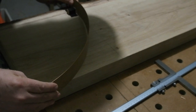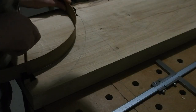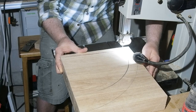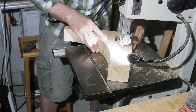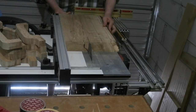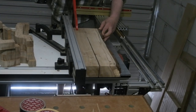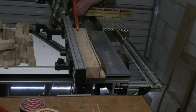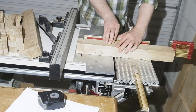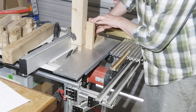Little blocks, sticky tape and an odd bit of edge band help to rough out the curve, then to the bandsaw. As I cut the bottom pieces of the front leg, you can see a huge crack in this slab — though not all the way through, it did go end to end and very much limited how I could cut the pieces. The curves aren't my ideal orientation on the grain, but I really didn't want to buy an extra slab for a personal build. Before I get to cutting the tapers, I'm cutting the tenon in the lower leg that'll intersect the base — it needs doing at this stage as, with all the tapers and curvy bits to come, it serves as a datum for 90 degrees to the base.